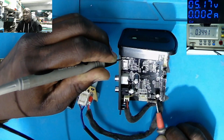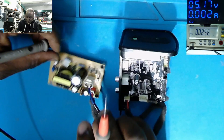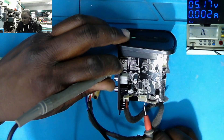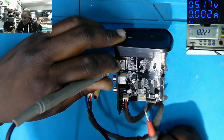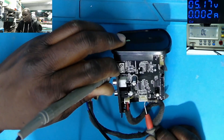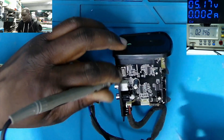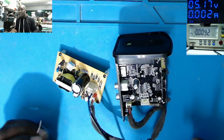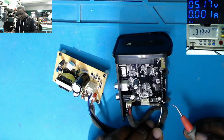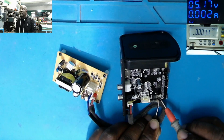Output: 0 volts. Input: 0 volts. So on this linear regulator 7805, we don't have anything — even the input voltage is missing. We have a resistor here which looks bad, like a blown-up resistor on the input. On one side of the resistor we have 18 volts; on the other side, 0.24 volts. That output side of the resistor goes straight to pin number one of the linear regulator. Exactly zero.